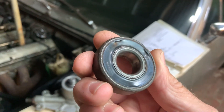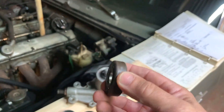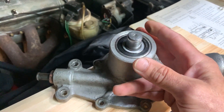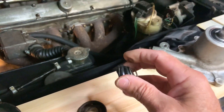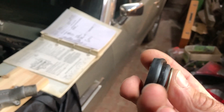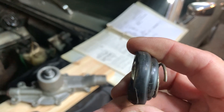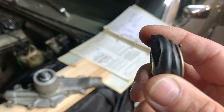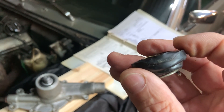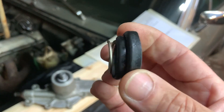What I didn't show is the back — someone's had a go at putting this bearing in either with a bit of pipe or a punch or something. It's a bit of a shame; whoever rebuilt this water pump in the past didn't really have the correct tools or knowledge to do it properly. But it is going back together nicely now. Here's the seal — ignore the fact that the carbon thrust has gone, I had to destroy that to get the impeller off. You can see when it was inserted it wasn't inserted very well — there's a great big blister where the seal was just hardly put into the pump properly. It's amazing that I got 19 years of running out of this car without the water pump making a noise or leaking.